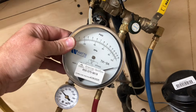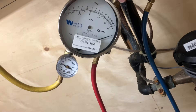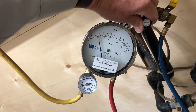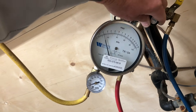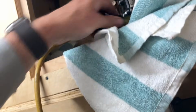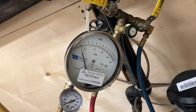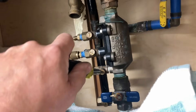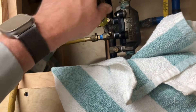The needle should stay pegged on the high side, which it is. Now we're going to slowly open B until our needle drops to two PSID. There's a little pocket of air there. Okay, two PSID right there. Now we're going to take that screwdriver and open test port number two. The needle should not go below one PSI — it didn't move at all. Check valve number one has passed testing.